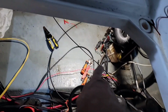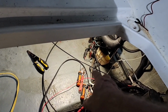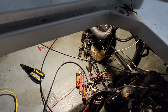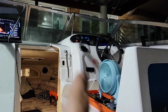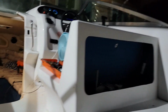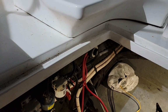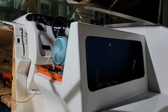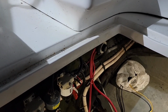And in the wiring from the 5.7 liter, there was an extra wire in a harness that I was able to use that this diesel didn't need. I turned that into a hot leg coming up from the dash on the keyed switch. I need to pick up a relay. I have it wired direct up there right now, when the key is on, the pump runs. But I'll either go to an auto parts place or just order it online. The relay takes the load, not the wire directly from the ignition switch.